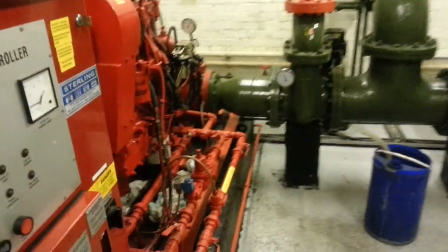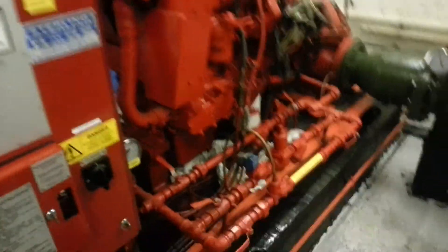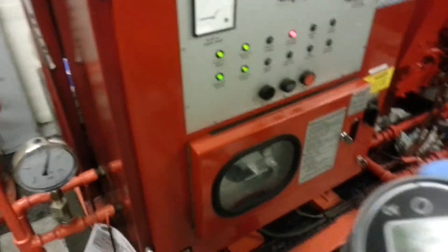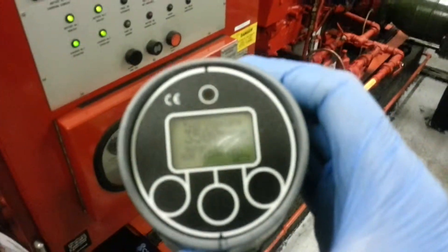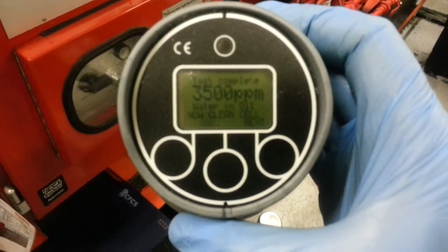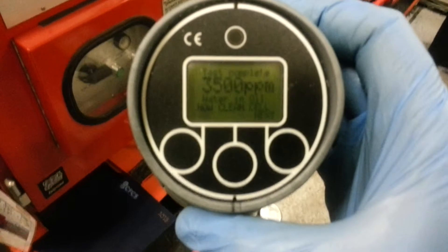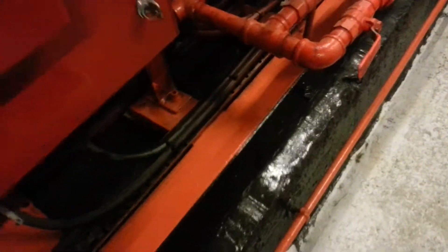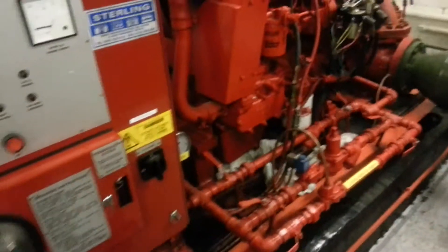There are two inches of black detritus on the bottom. We've just done an initial pass-through and then we've just done our digi-reading. You can see 3,500 parts per million of moisture there. And like the one yesterday, allowable is 200. So hence the reason why this fire pump isn't running or in line.